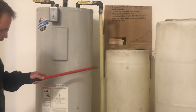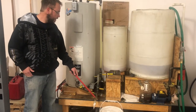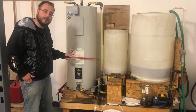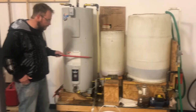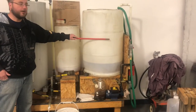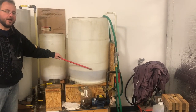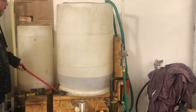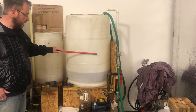The mixture is allowed to settle and cool, and waste glycerin is emptied off this bottom port right here, leaving the raw biodiesel in the hot water tank. The same pump then pumps the biodiesel through a tube at the bottom into this finishing tank — a roughly 200-liter, 55-gallon plastic barrel turned upside down with a fitting at the bottom. In here the biodiesel is dried and cleaned.